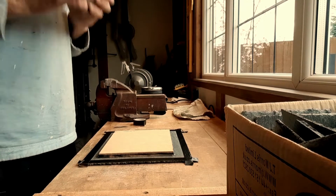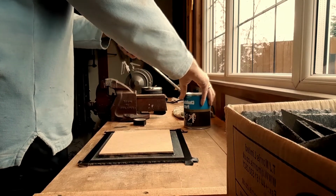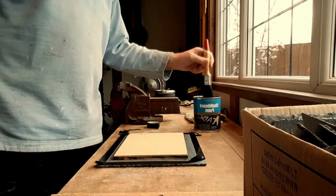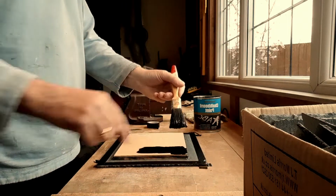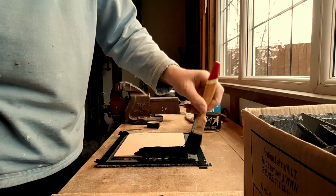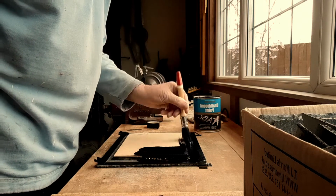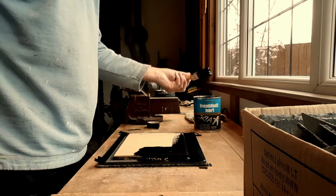So yeah, just give your paint a good shake. It's just a water-based paint this, and it's quite easy to apply. Get the lid off. Yeah, okay, an inch brush or whatever you've got, and just give that a good coat. And you see, you can just go onto the tape there and over all the sealant. Although it looks shiny at the moment, once it's all dried, it will dry matte, just like the slate really, almost the same colour.